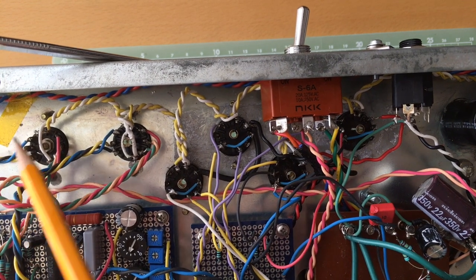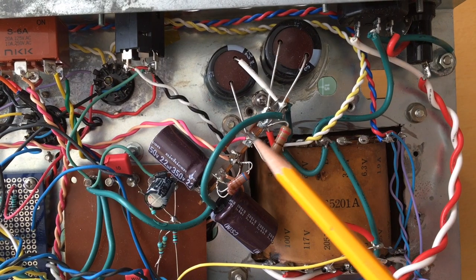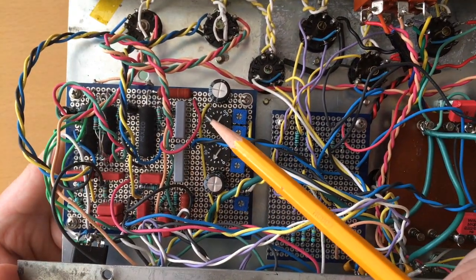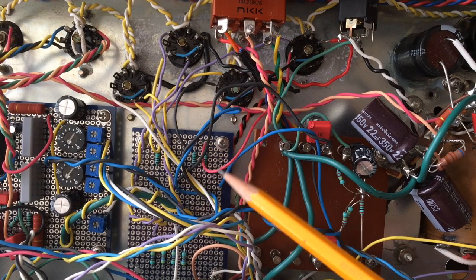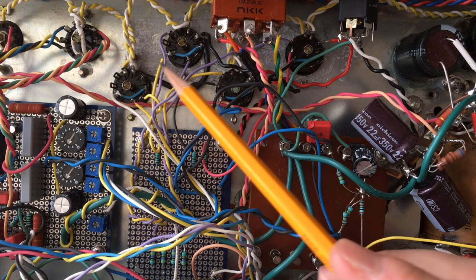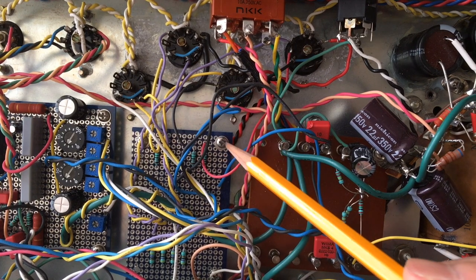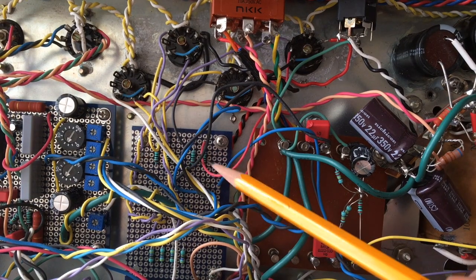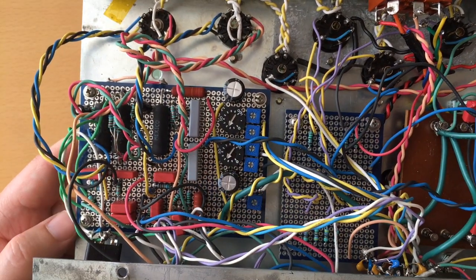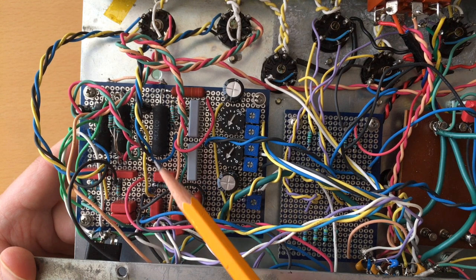Also, here you can see the 3 anode, grid, and cathode connections of each preamp tube. The idea was to just use these eyelets and this turret board I had lying around for the power section, while using this perforated board for the preamp section, and mounting the screen resistor and grid resistor of the power tubes directly on the tubes. As I found out, the point-to-point wiring that was required around this power tube was not really solid enough for me, so I ended up adding this extra board with a lot of connections but just 8 resistors. Why did I choose a perforated board for the rest of the amp? Well, it's a good compromise between wiring the amp myself and being able to do a few changes here and there, and compactness.